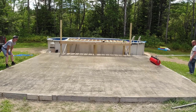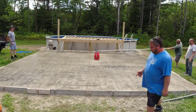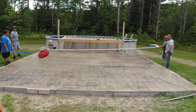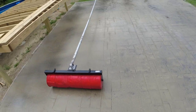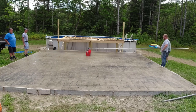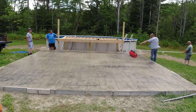One thing to remember when you're stamping in this heat — it feels like about a hundred degrees right now. On a pad this size, about 24 by 21, when you start stamping you can't stop. You might have ten minutes to get from one end to the other. You've got to really get it stamped fast. When we got to these last couple passes, we noticed the grooves weren't going in quite as deep, which means we should have either started earlier or gone faster. So we're going to add some weight to it to help with the grooves.